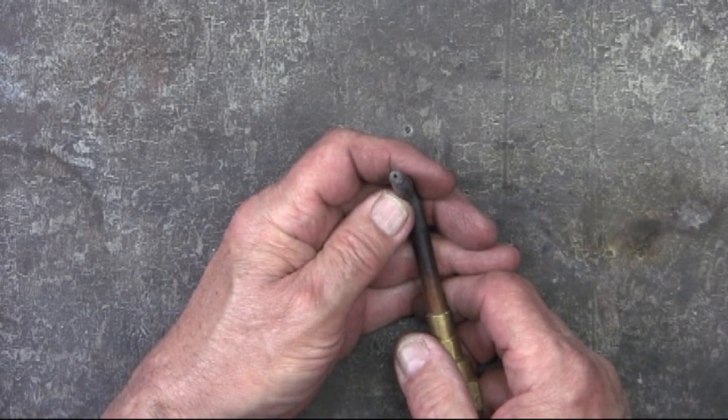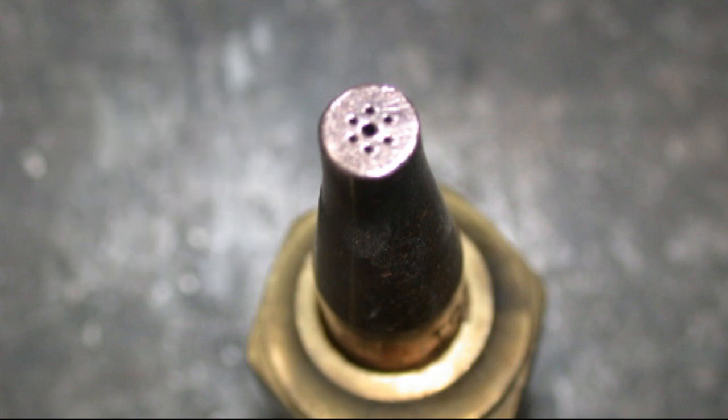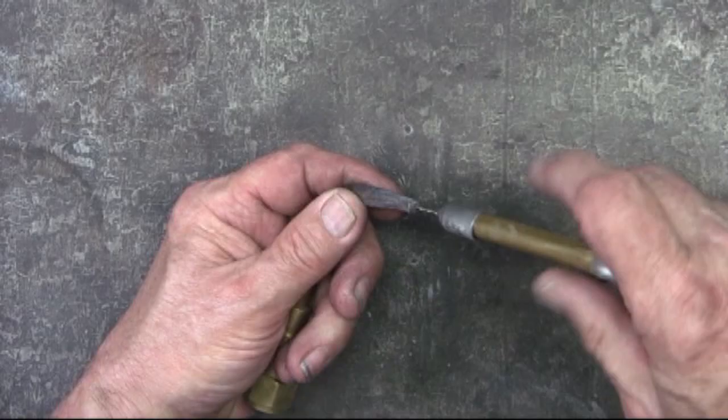But where you might really find this useful is especially on the cutting tip on your torch head. That is more likely to get a spark — just a tiny piece of metal fused right up in the tip. When using the drills to drill out one of the tips, I'd suggest using a minimum amount of pressure.